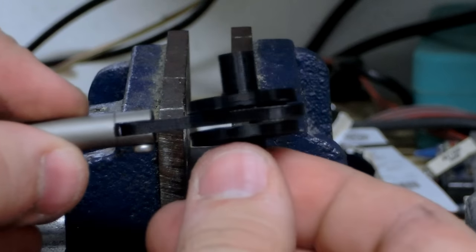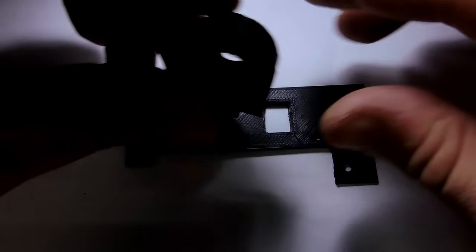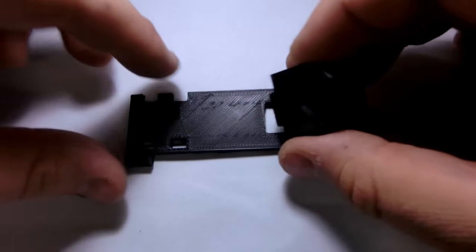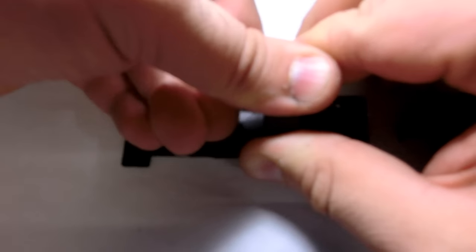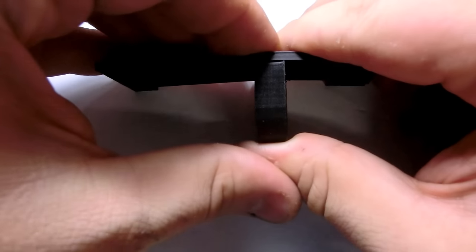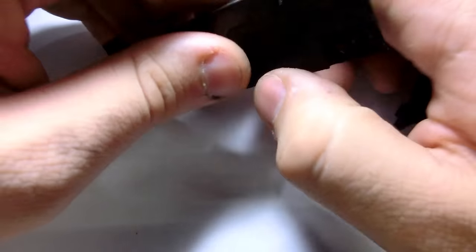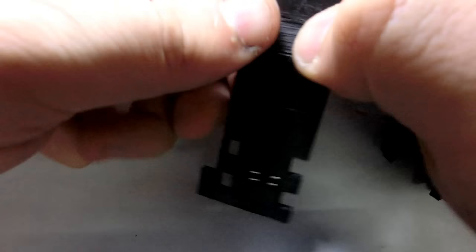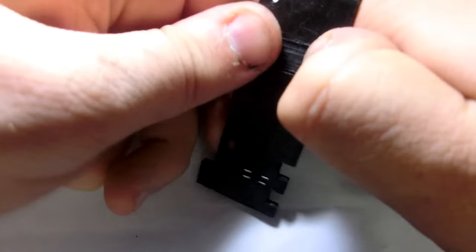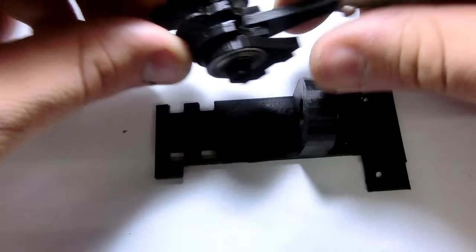Runs very smooth, that's good. Let's assemble the motor. First I'm pressing in the guide, which I don't need later on. The cylinder had such a long throw that it just blocked when it tried to push it back in, and I needed that guide. But later on I made the throw much shorter, so I didn't need it anymore and the motor runs faster.